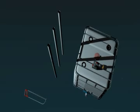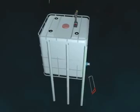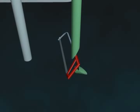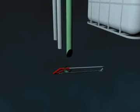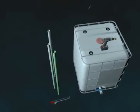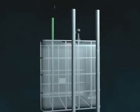Next, cut three pieces of 2-inch or 50-millimeter sewer pipe to a length of 1.5 meters. Designate one of the pipes as the feeding pipe and cut the bottom at a 45-degree angle so that the food waste you put in can slide out easily into the bottom of the tank — this gives the pipe a pointy end. Sand any rough edges, soap up the pipe and the inner ring of the uniseal, and firmly push the pipe through the uniseal, twisting as you go, until it reaches the bottom of the tank and stops.